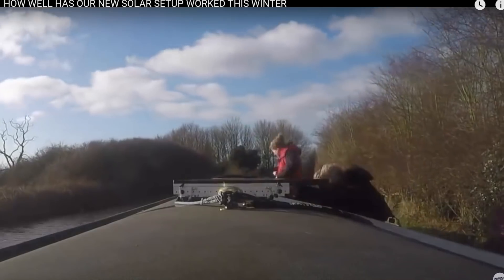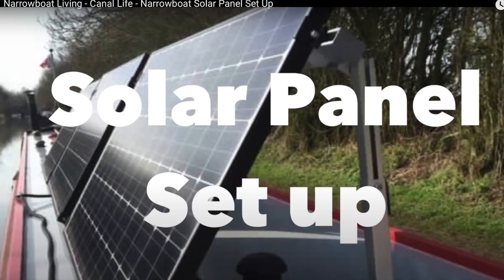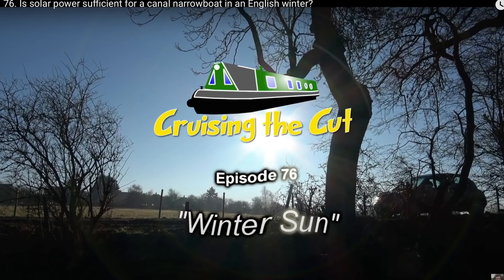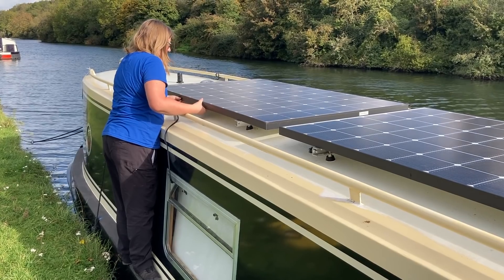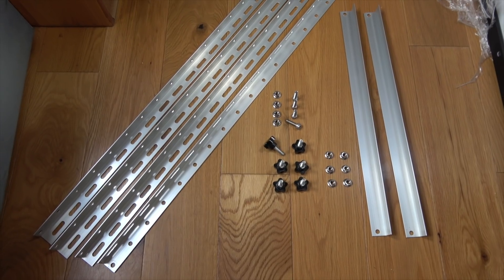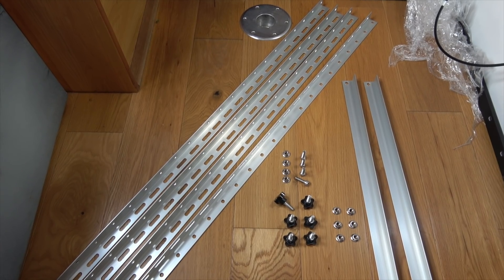When deciding what brackets to use, I referenced several other narrowboat vloggers. I looked at Minimalist's video on full tilt, a great video from Never Enough Cruising featuring a specific bracket from a solar provider with multiple tilt options suited to slimline panels, and David from Cruising the Cut's video on winter solar — really helpful for sizing panels to get enough wattage in winter when sunshine hours are less. I decided to go for full tilt brackets that are the exact width of our panels, appropriately rated for the panel size, with options to tilt at different levels depending on the time of year.